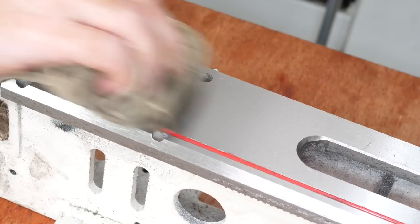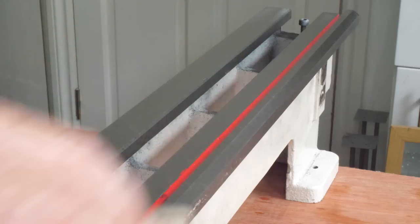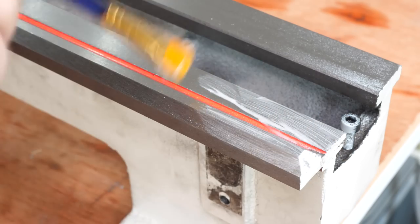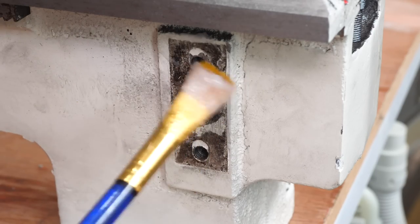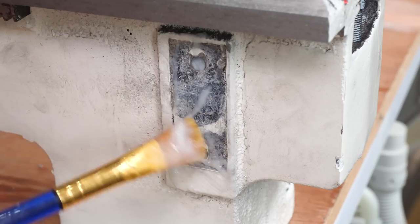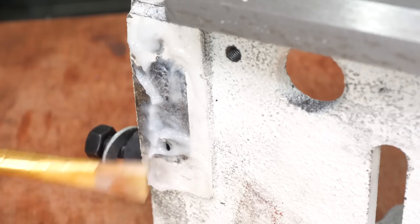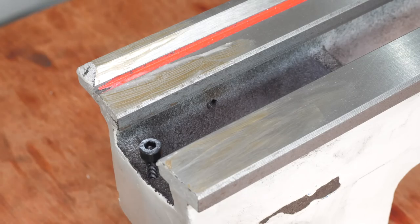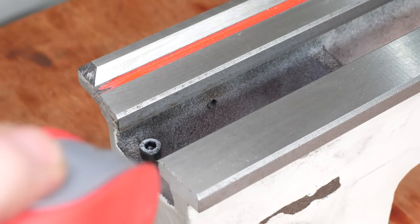The layer of gritty grime dissolves away easily in WD-40, but once it's been wiped away it's a lot more clear how much paint spatter there is towards the tailstock end. Water-based paint stripping gel should make it easy to remove the spatter without the need for any sharp scraping tool, which might damage the ground surface. While I'm waiting for the stripper to take effect, I also want to remove the paint from the points where the lead screw hanger bearings are mounted — this will ensure metal-to-metal contact and make the feed as rigid as possible. After a few minutes to dissolve, the paint spatter wipes away easily with a rag, and some WD-40 ensures no water from the gel is left behind.